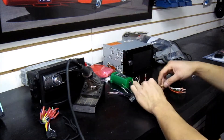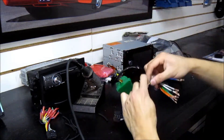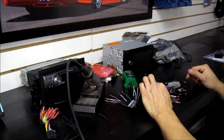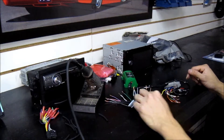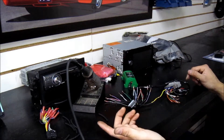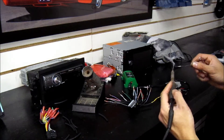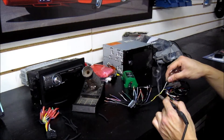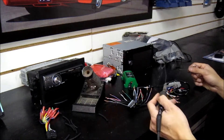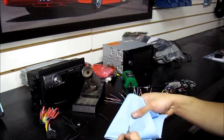Twist as tightly as you can so you don't have any burrs sticking out and you make a nice solid connection. The last thing you want is a wire sticking out — when you put the shrink tube over it and heat it up, that burr can cause a short. Put the iron underneath and start soldering. You should be cleaning the tip as you go along — something is better than nothing.